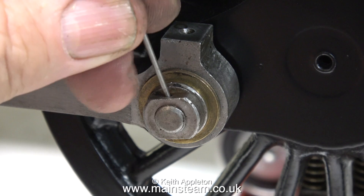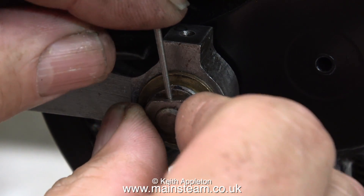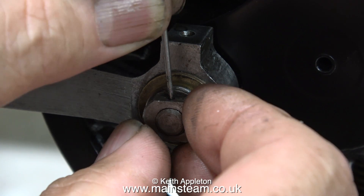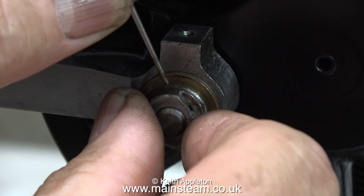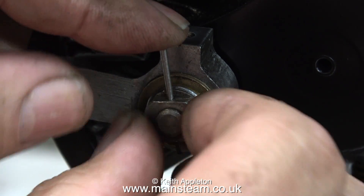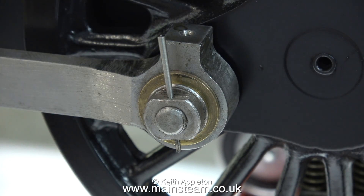All I'm doing in this video is just checking the fits of the nuts on the crank pins. They're not a very tight fit, and I could loctite them on, but I'm not going to do that. The taper pins will hold them in position once I find the position. When I find the position for the nut on each of the crank pins, I will tap the taper pin firmly in place, mark the correct length for each taper pin, and then remove them and cut them to size.